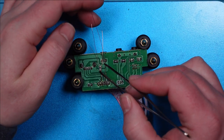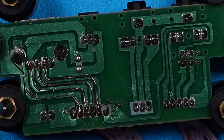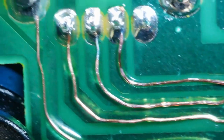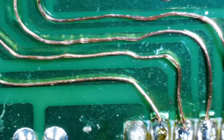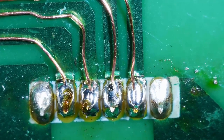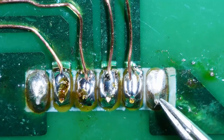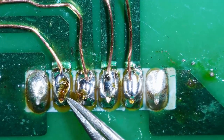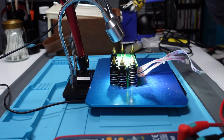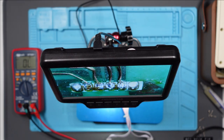Right, I'm just going to try and tidy these wires up now and just get them running to where they need to go. That looks pretty good. Check it out under the microscope. Okay, so they all look like they're nicely soldered on there, and we've got them all running around. None of them are touching and they're all going to those four points up there. Yeah, I'm quite pleased with that. I suppose before I do anything else I should really check to see whether we've got continuity. Yeah, so we've got good continuity across all of those now.